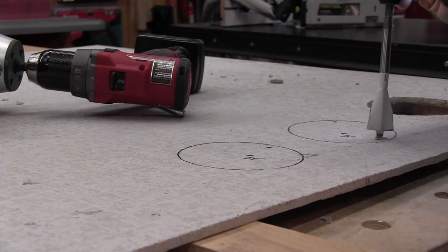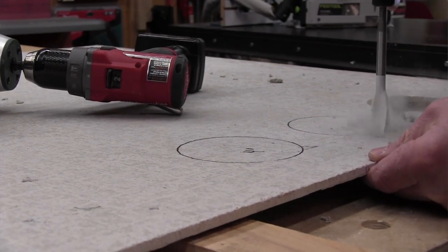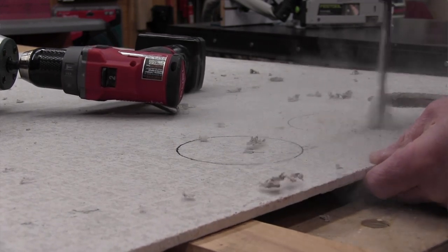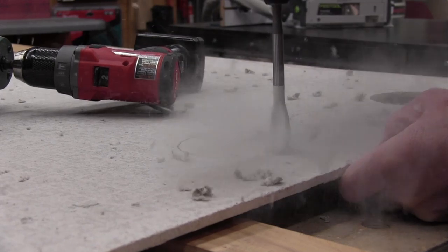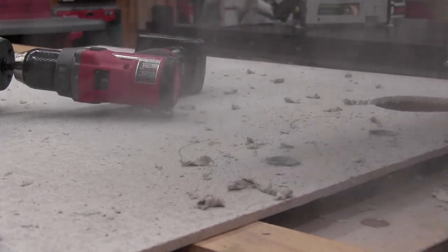This is a huge efficiency and time-saving tool when installing underlayment. As far as accuracy goes, using the tool takes a little time to get used to — the cut line is definitely not like cutting with a circular saw. Here's a tip: when cutting circles, you first need to cut a pilot hole. We use a 1-inch Bosch spade bit for that, which does create a little dust, but then you use the shear head to complete the circle cutout or HVAC vent cutout.